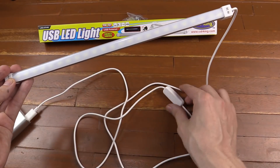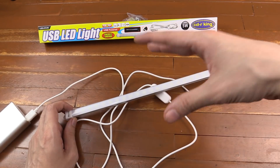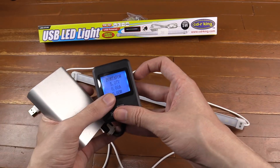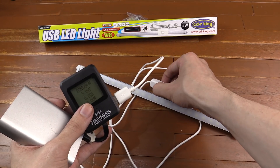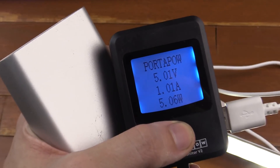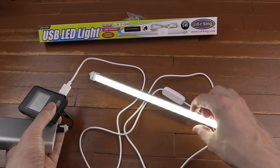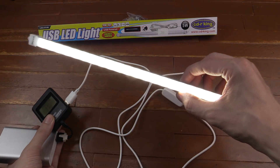It's nice that it's got the switch and the long cable, so pretty impressive — but is it really 5 watts? On all their previous USB bulbs when we measured them they were nowhere near what they claimed. So let's plug it into my USB watt meter and measure exactly how much power it consumes. Switching it on: 5 volts, 1 amp, 5.05 watts. So it is a true 5 watt LED light — finally they've produced something with true numbers, and this light is extremely bright.